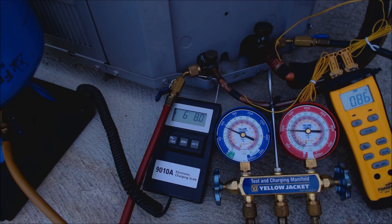We're pretty close, so we'll let that sit for a little bit and check again. If it's calling for 8 degrees, I like to be just a little bit higher — maybe 9 degrees — but basically anywhere within 3 degrees plus or minus of 8 is the correct refrigerant charge. With a thermostatic expansion valve, you can also go inside and check the delta T across the evaporator coil to make sure you have an 18 to 21 degree temperature decrease. With a piston, high humidity in the building can affect that reading. With a TXV, it should handle 18 to 21 degrees unless there's another issue.